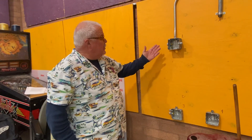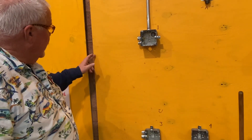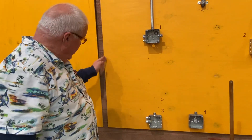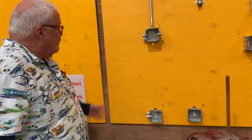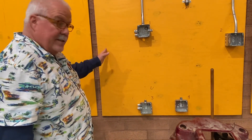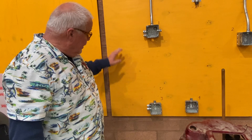What we're going to do: I want the students to make a conduit bend that comes from this connector, has a box offset, goes back to the wall, has a 90-degree bend that stays away from the edge of this — maybe an eighth of an inch. It comes down here, has another 90 in it, then has another box offset to go into this connector. After that, we'll do the same thing with this half-inch conduit, and it has to be within the inside of that. This doesn't leave a lot of real estate to make these box offsets without getting in the way with those 90s, so this is more challenging than it's usually perceived as.